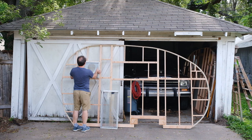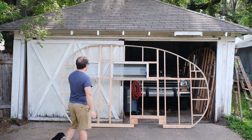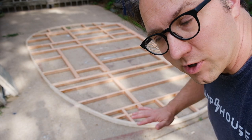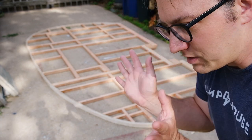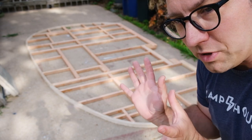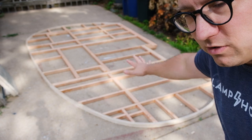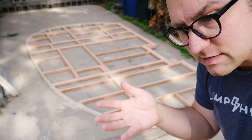So having test fitted the windows in, so I know that they're not going to need some adjustment, I'm ready to go ahead and put the plywood down on this. So I've brought it back over here and I've laid it on my flattest part of my driveway, because you really don't want to be putting this paneling on with any kind of bow or anything on that wall, because you will be essentially baking that stress into that panel when you fix it to the wall. And you want it to be nice and flat,